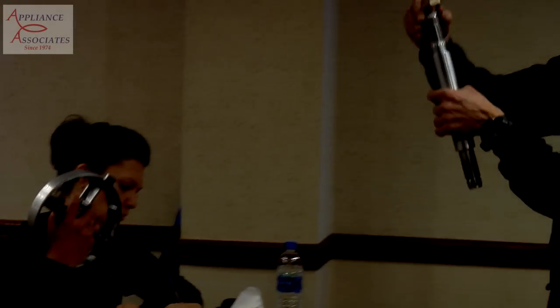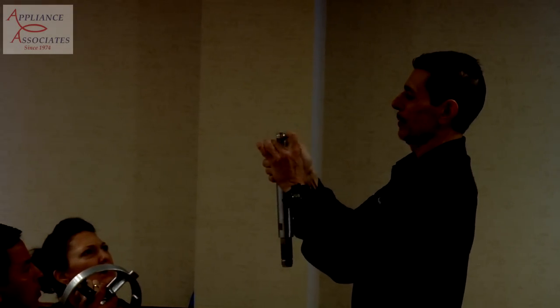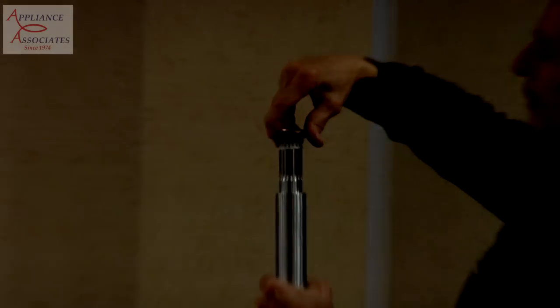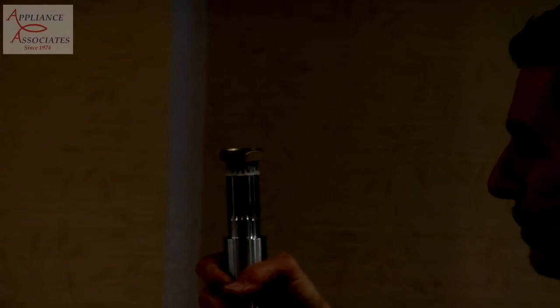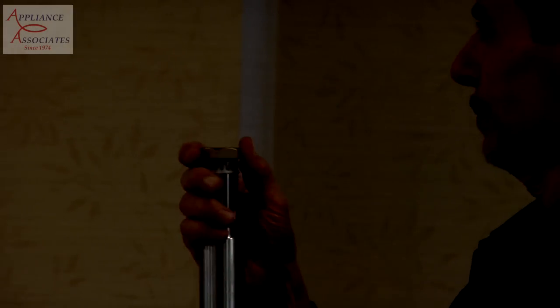I'm going to put this part together so you can see what it does. So what you do is you slide this on. It's much easier when it's mounted, of course. And it hits the groove that sits right here. And then this nut screws on it. These are kind of rough to start sometimes. And as the nut gets tightened, it grabs the plastic nylon as well. Now, this end I mentioned is not threaded. So this end and this end are identical. I'll pass it around like that. Those axles are made in our factory. They're spun on our lathes.